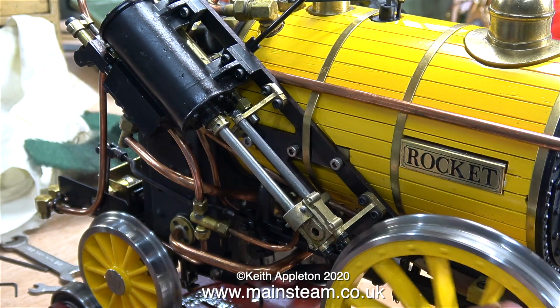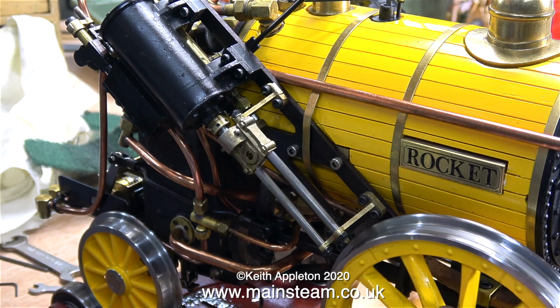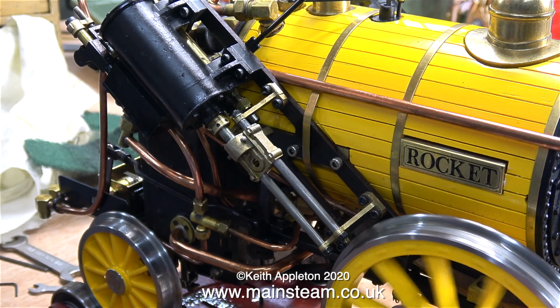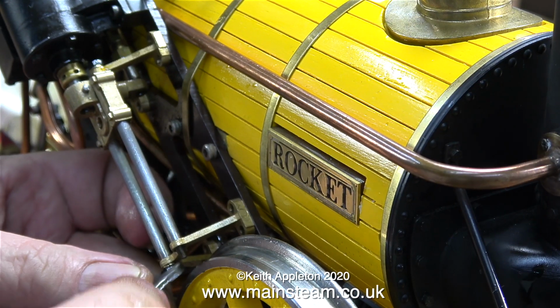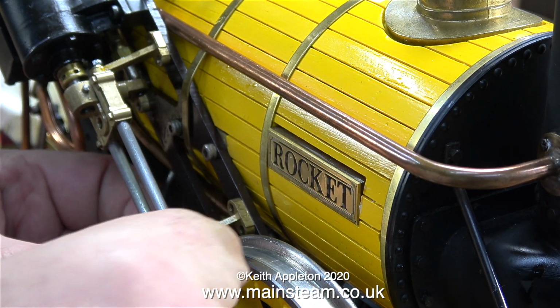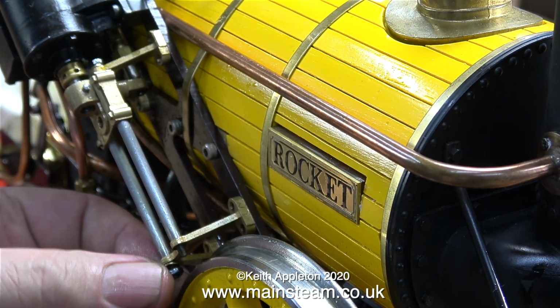And yes, it did make a slight difference, but I really don't think it was anything to do with the Scotch-Brite. It was because the piston rod was being moved up and down by the action of the Scotch-Brite. For some reason, this piston is sticking in the cylinder bore, so I have no choice now but to dismantle this side of the engine.